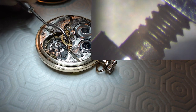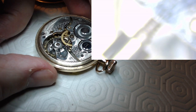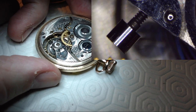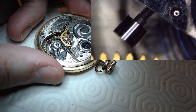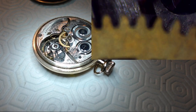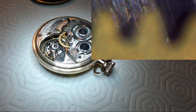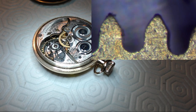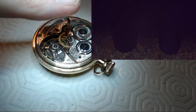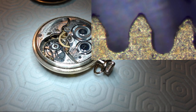If you want to look at teeth to see if there's a problem, you move over, refocus on the stereo microscope, and eyeball in through the other lens to find the tooth. There's some teeth there — and I can zoom in on those teeth. There you go — you can also see dirt on the peak of that tooth on the left-hand side. I'm pointing at one of the teeth on the edge here.